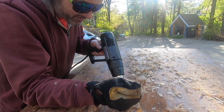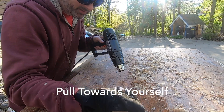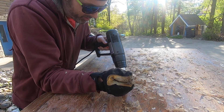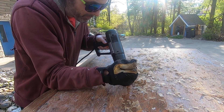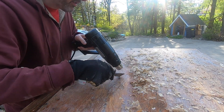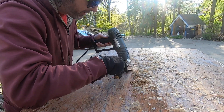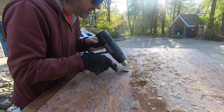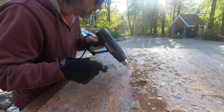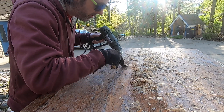A couple things I've noticed just from doing this: one is I think it's easier to pull the putty knife toward you than to push it away — you can use your whole torso, so I think that helps. In terms of getting this stuff off, you can put your heat gun right in front of the putty knife, or you can heat up an area until you see it start to bubble, and when it bubbles it's probably ready to come up. You can then go scrape that area while you warm up a different area.